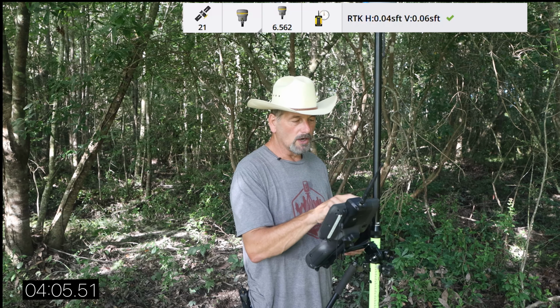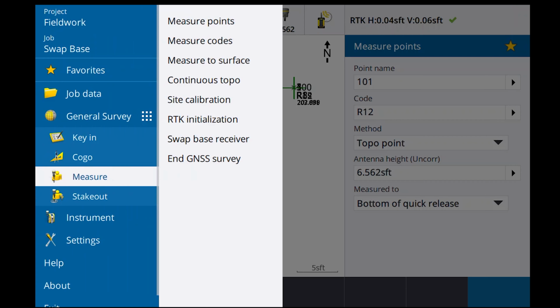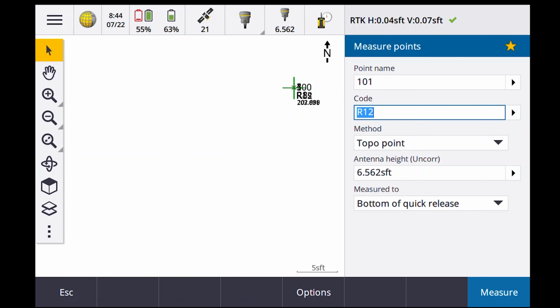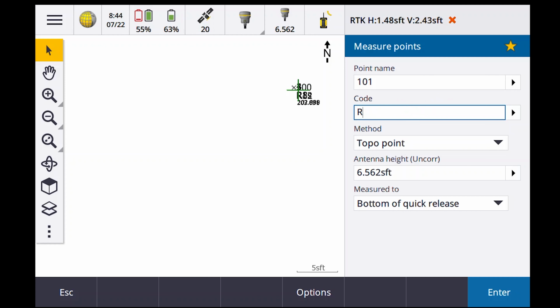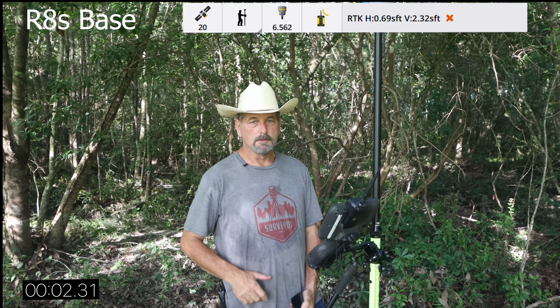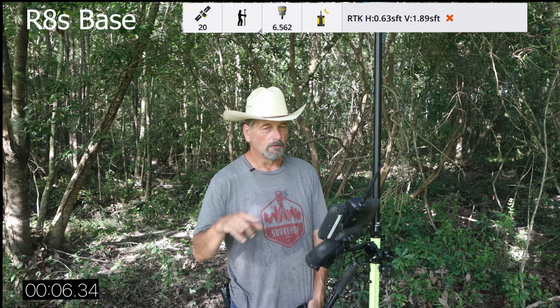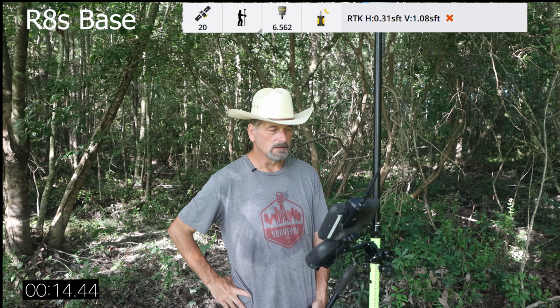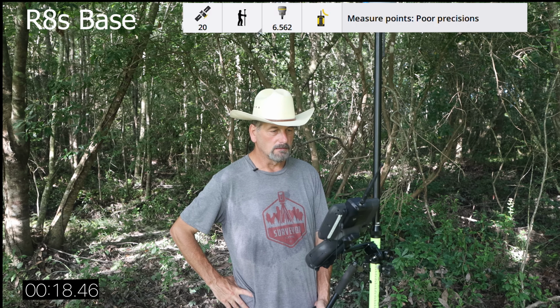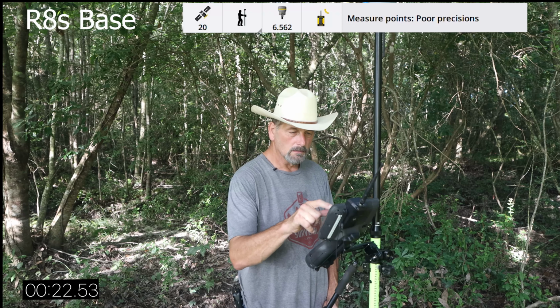But anyways, now let's switch over. Let's go to measure. Let's go to swap base. That was a 12. Let's go to the 8. So, waiting for information from the base. I'm going to reset my clock. Say R8S. I'm going to say point number 100. Yep. Measure. Start. Okay. Start the clock and see. I reset the satellites just before I started with the 12. That may be why it took longer for it to get its position, because it looks like we're going to get it now pretty quick. Kind of what I was expecting. This is with the R8S, actually, which is what that is supposed to say.